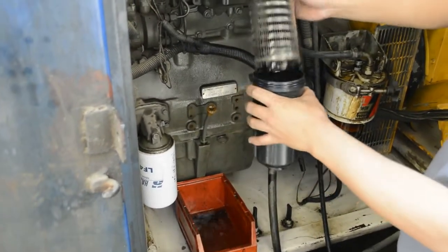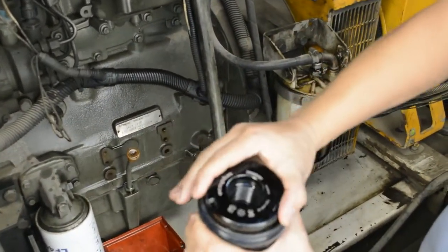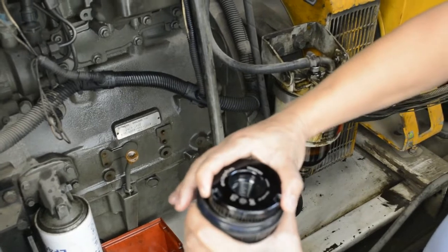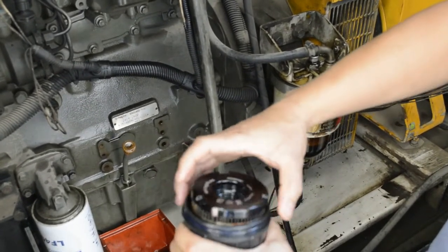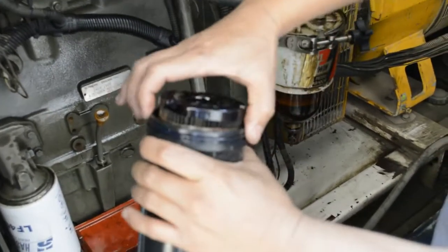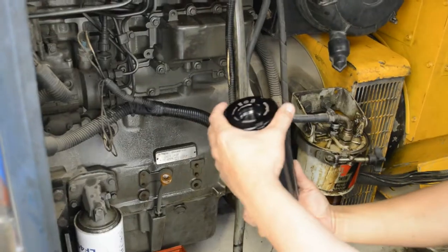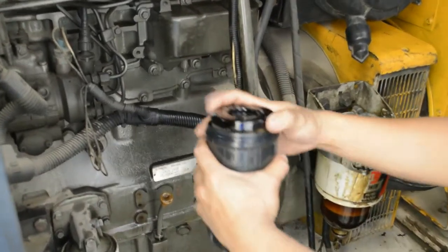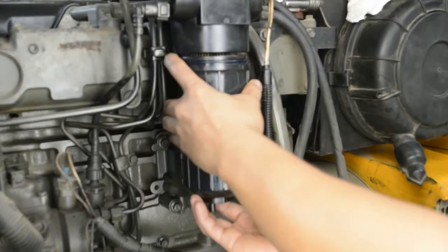This is the Perkins Eco Plus fuel filter. As you can see, the fuel filter element that is attached on the fuel filter housing is shaking, and the o-ring is not very well fitted, so there is a tendency to cut. Another disadvantage of using the Eco Plus fuel filter is that it is expensive and not easy to find in the market.